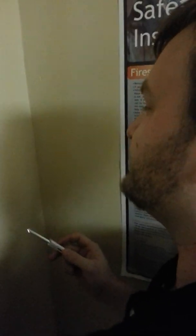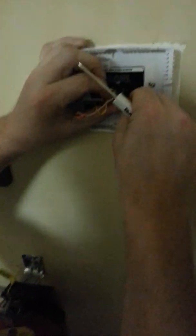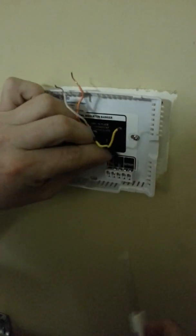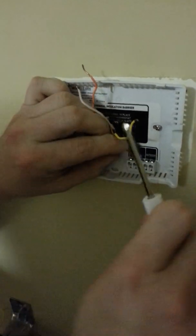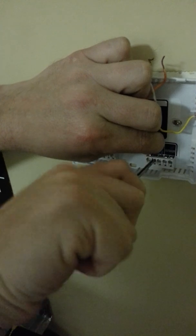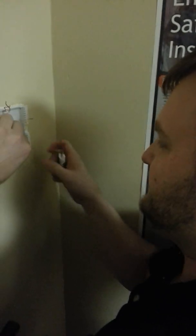All right, hooking them back up. Like I said, if you're not sure about your wiring, please label them. I've done it a half a million times and I've got it down. This one's the common, we're hooking that up first. With the power off, the main thing is to make sure you get it right. If you have any question about it, go to the air handler or the outdoor unit and make sure every wire is consistent through all pieces of equipment. If you have a package unit, these will work with package units — just make sure your wiring is going to be outside. Make sure you have a common, because if you don't have a common, don't even take it out of the box because it's not going to work. It's more of a professional application, made for newer, higher-efficiency equipment. You can use it with older stuff, provided you have a common.